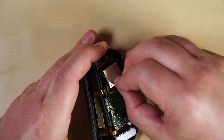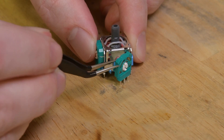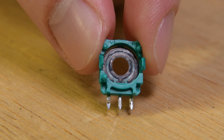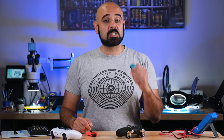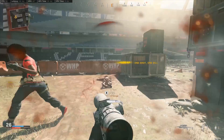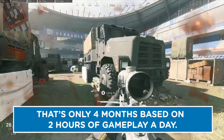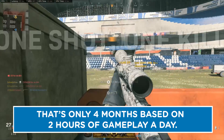We've taken a detailed look into this issue for both the Nintendo Switch and PlayStation 5 controllers, and found that drift was mainly caused by the gradual wear on the resistive elements inside the thumbstick housing. It's expected that components will eventually fail, but the reason these things have caused such a fuss is the extremely limited lifespan — a mere 2 million cycles that could potentially see a controller failing in as little as 4 months, based on only 2 hours of gameplay a day.